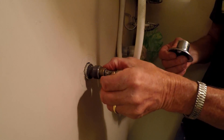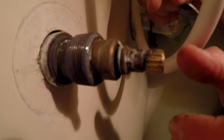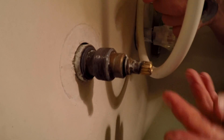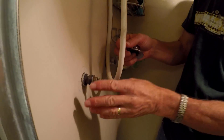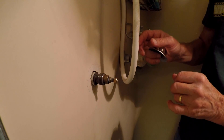And there we have it — see those are flat spots on here. That's where we're going to put our wrench on there to twist out this whole stem, and then we're going to take it down to the hardware store and get the right parts. So the next step before you go any further than this is to go shut off the water to the house.